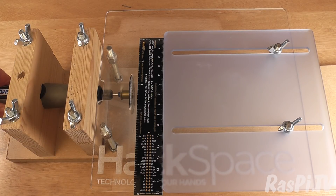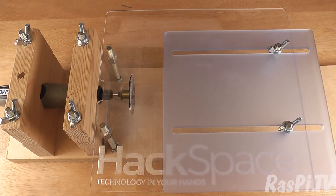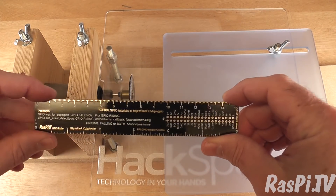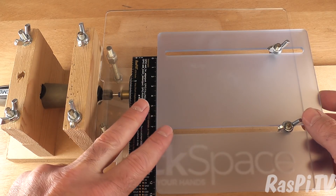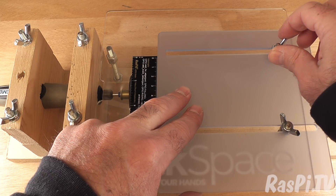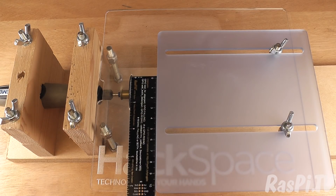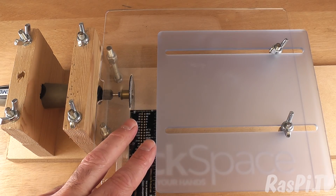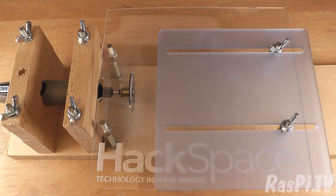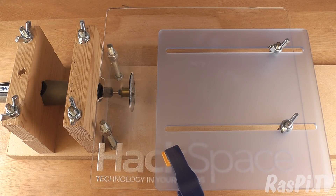So how do we use it? The Dremel flexible snake attachment is already clamped to the board. The table is already placed on the base, and we have a fence here which we're now going to adjust so that it's exactly the right width of the ruler to take off the protrusion. The way we do that is we just place the ruler on the disc, tighten the wing nuts, and there should be a loose sliding fit — great. But if we take the end where the protrusion is, it shouldn't go through. It doesn't — you see, it's blocked. So let's tighten that up a little bit more and put an additional clamp here just to hold the fence down to the base of the table.